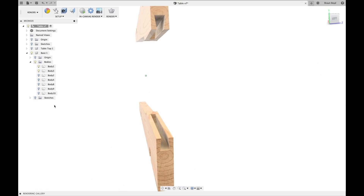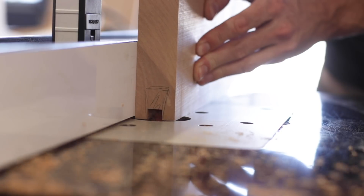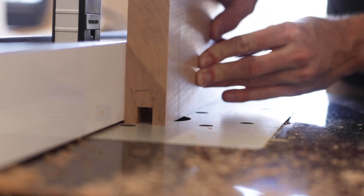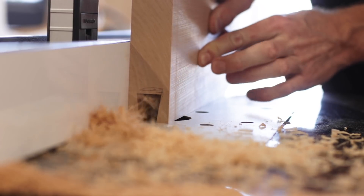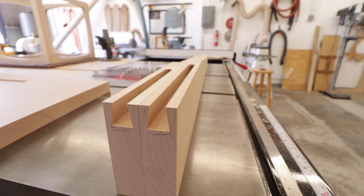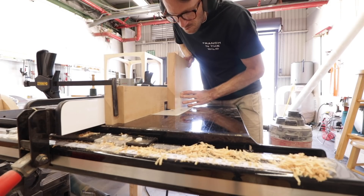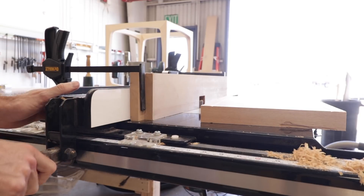So now with all the parts cut to rough shape but final width, I could then focus on cutting the joinery, and for this I use a stopped sliding dovetail. The main trick here is to gradually clear out the majority of the mortise with a straight bit, then switch to the dovetail bit and take one final pass to create that dovetail mortise. With the dovetail mortises cut, I can then focus on cutting the tail portion. I always like to make a very shallow initial pass to establish my cut line, and this will help ensure minimal tear out since I'm cutting straight across the grain. I then just keep moving in until I sneak up on a really nice fit.